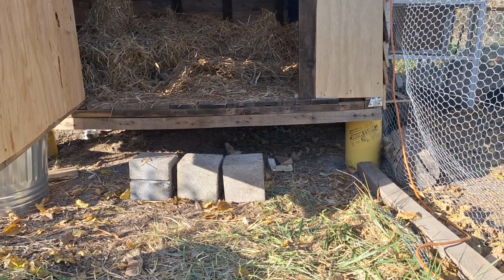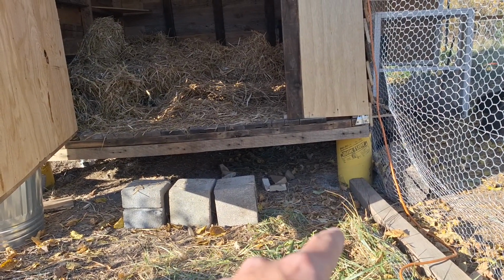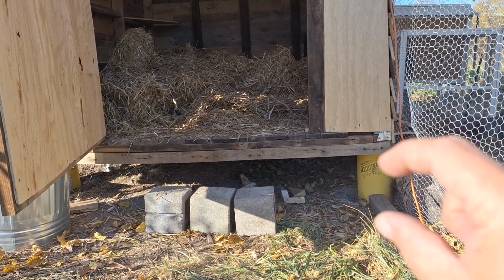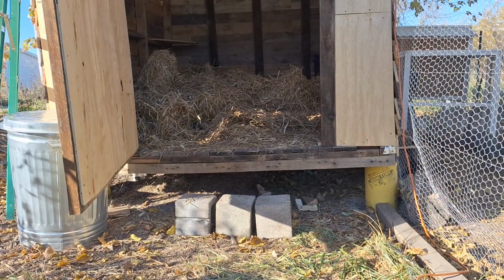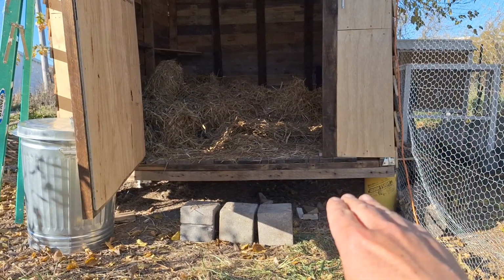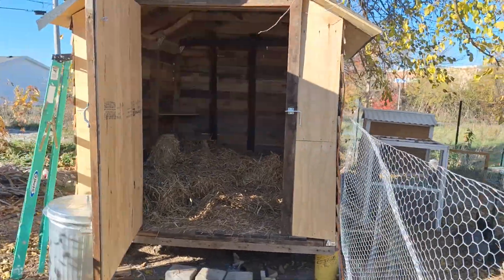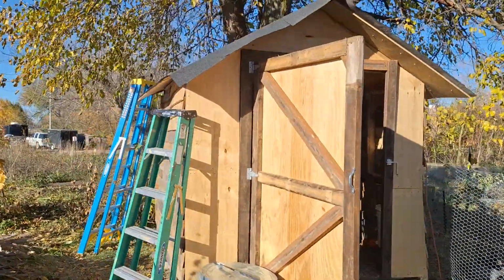Now for the foundation itself, we have separate pillars of concrete that we dug down about 9 inches, and we put those forms in there. We did mess up on the top portion of the concrete, because it was too cold. It was right around freezing, so it didn't set as much as we wanted. So then the actual building kind of collapsed down, and that's when we started really having problems with keeping it square. So visually, because of the boards, we're able to make it look as if it was square.